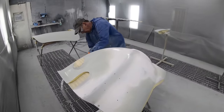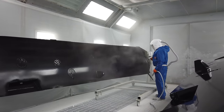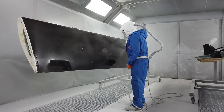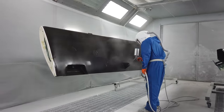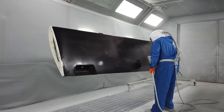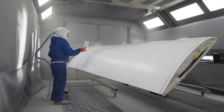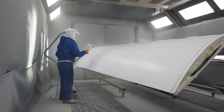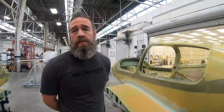Currently, our paint system, the next stage after prep for prime, the primer is an anti-static primer. It is carbon-based. We use it to help dissipate the static charge from a composite aircraft. What that'll do is it'll slowly dissipate the static charge out to the static wicks that are on all trailing edges of tips, stabilizers, and rudder. At that point, we measure prior to paint. We measure the static dissipation of it with our megohm meter, giving us a rating, pass or fail.